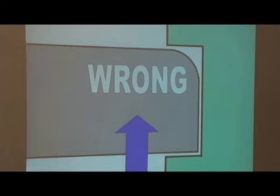The way you can tell is you go to take the check cover off, and as you pull the check cover off, instead of the spring being contained, the spring is loose and the cover has all the spring tension underneath, and that's because the retainer clip pushed out of the holder. So Watts' way of making sure everybody does it correctly says do not disassemble the spring assembly and buy the whole assembly. Well, a relatively inexpensive spring clip can be bought if you have to replace the spring, but it's critical that you put the retainer clip back in the right way.